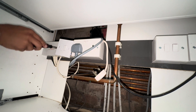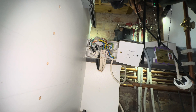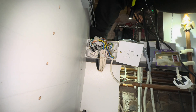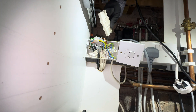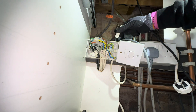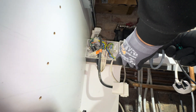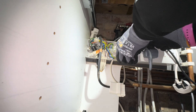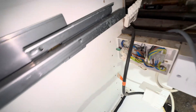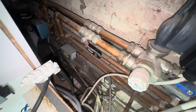I'm at that point now where you just can't see the wood for the trees and you're starting to get a little bit frustrated. To recap: we've checked the boiler - that's obviously fine because it's been wired in off a plug and it's staying on - so it's obviously something to do with the wiring. I'm checking down the back to see if there's any breaks in cables, and I've come across something. Found down the back there a dead mouse and a leaking zone valve.